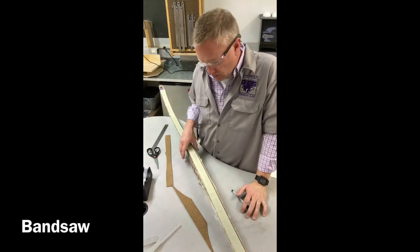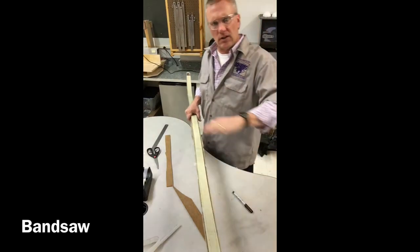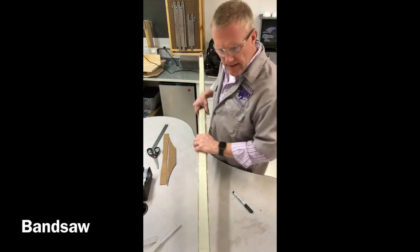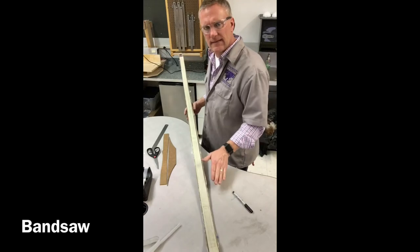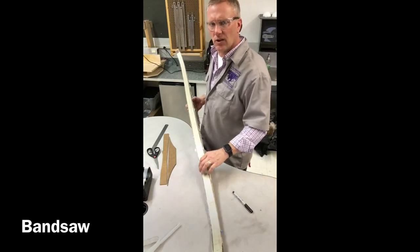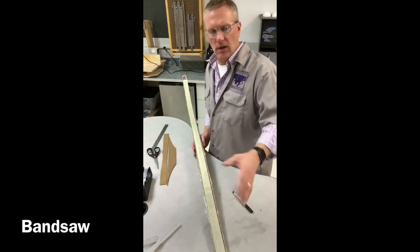Now that we've got our drawings on here — and granted it's kind of messy, understood — some people may ask why did you do it on the front side? Well, the plans ask you to draw it on the front side, but also I've learned through trial and error that when you're taking this through the bandsaw, it is best to have this curve always against the table, rather than something like this, because then you'll get a lot of vibration and that causes a lot of trouble. So if you can always just keep this flat on the table, you will find that you will have better results as you run through.